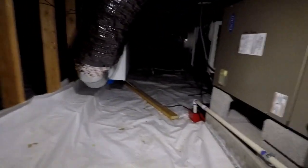Okay, let's go find the sitting room fan coil, because the best I can tell from trying to read that faded out writing, it said it was the sitting room fan coil. This is my sitting room right there. So, let's disconnect all of our wires and make sure red, white, black, and brown were disconnected outside. So let's make sure we don't have any continuity between those.